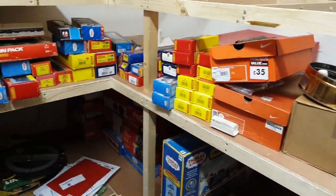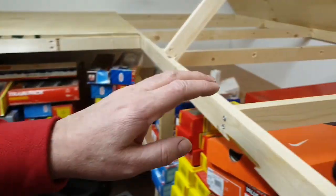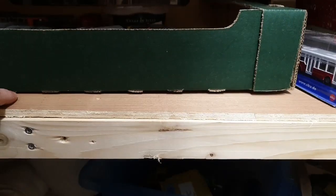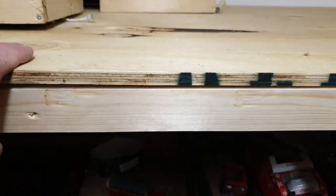You can see under the baseboards I've built shelves using the same method — 2x1 with cross beams of 2x1. They're all at 16-inch centers to give good support. For the shelves underneath, I've used 9mm ply, which is cheaper than the 12mm ply for the baseboards.